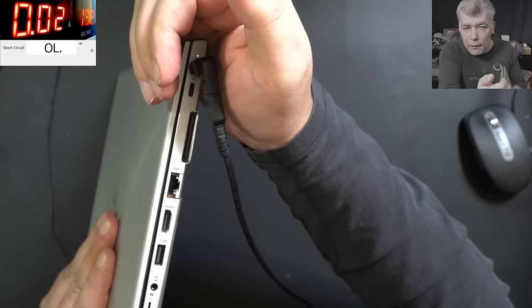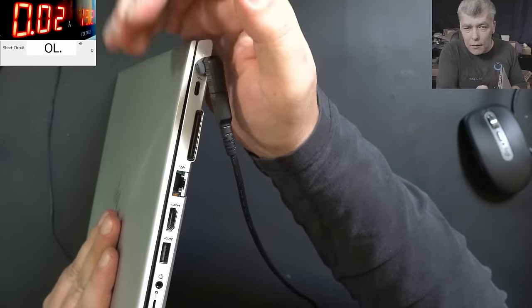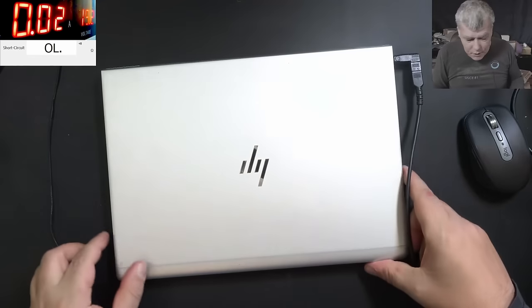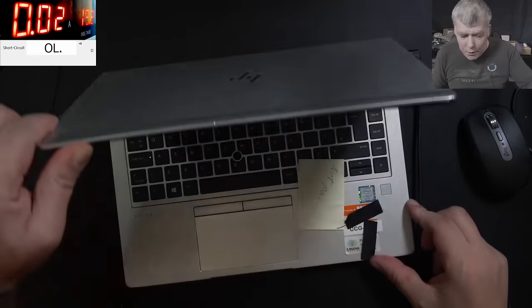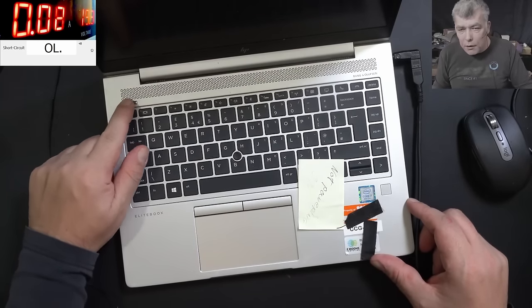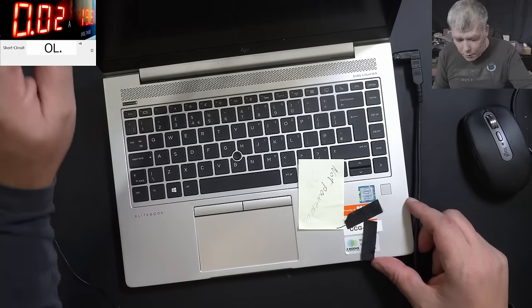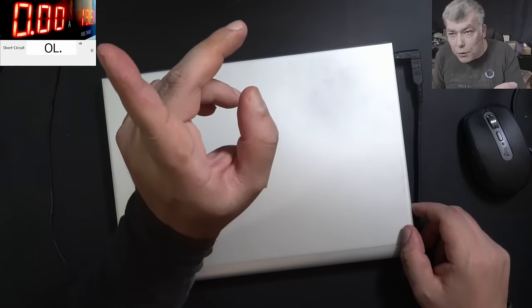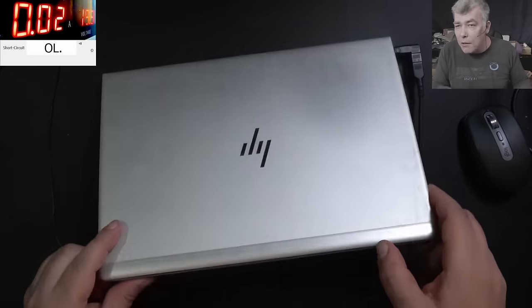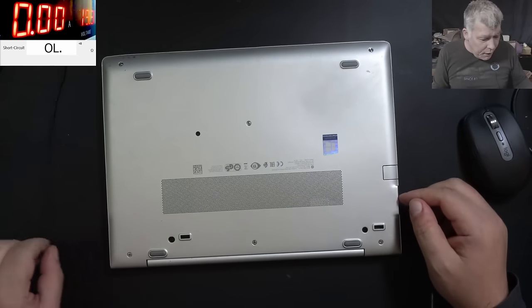The charger is kind of flushing - you can see 20 milliamps. That's a little bit too much for this kind of laptop. Pressing the power button, nothing happened. The EC chip is not reading the power button. I'm also curious what is taking 20 milliamps - you always have to pay attention to what is taking the current and why.